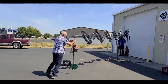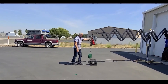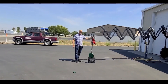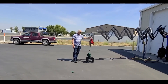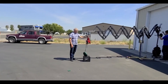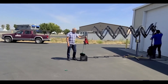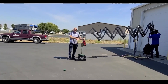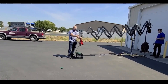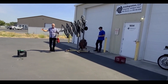So let's say this is your other press where you're going, and you wanted to unload — you bring it over, get it positioned in the press, and then the counterbalance is relaxed and unloaded. You'll probably have to push on that just a little bit to get it locked into the unload position. Once you have that unloaded, you can release your vacuum, take your load off into the press, and then get it out of the press and do your operation.